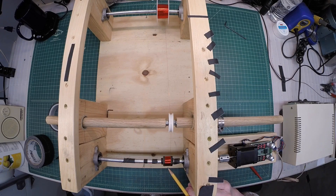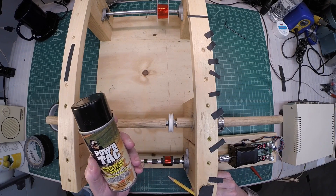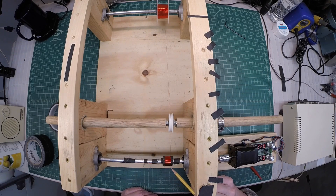In the original construction and a lot of methods, once I get to this first layer I would wrap some thin paper or tape. I'm going to forego that because I'm still concerned about my ability to wind the coil as tight, even though I got really good results on this first wrap. I'll probably get some grouping and I'm still concerned about fitting into what I think was a 19 millimeter window. So I'm going to forego that and just spray some power tack in between.